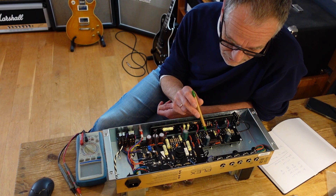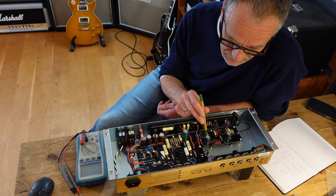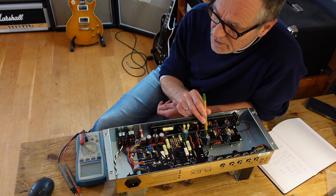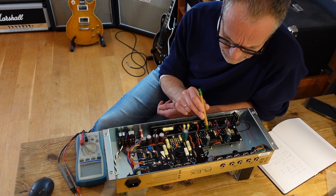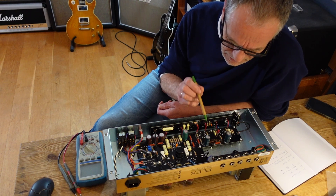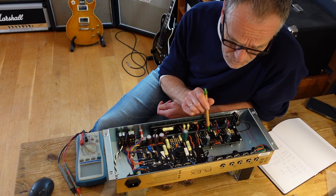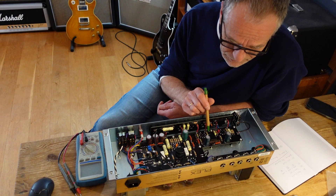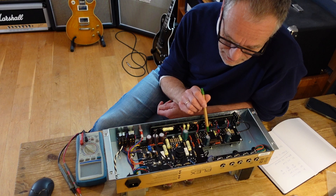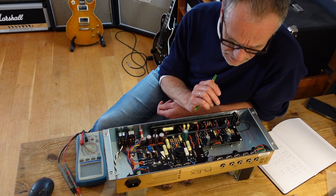The only deviation I could find was the fact that over the 820Ω of the third cathode — the input cathode of the cathode follower — is bridged with a 22 microfarad capacitor, which you can see in one or another Friedman amp, to increase levels on the one hand and shift tonality, shift the sound a little bit, give a bit more mids. I actually like this modification. Other than that, stock.